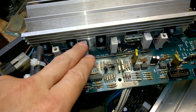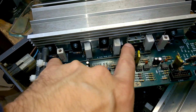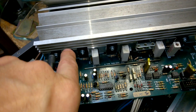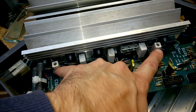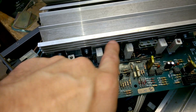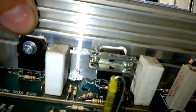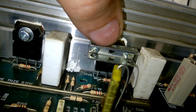If one of them is faulty, all the power gets divided by fewer devices — here we have five transistors. If one is faulty, the power is divided by four and doesn't spread to that MOSFET. In this case there were two resistors faulty, so all the power would have gone to only three transistors if you change the transistors only but not the resistors. One of the screws for the MOSFETs was faulty — the threads — and I came up with a solution for that.